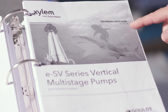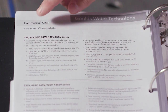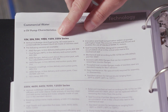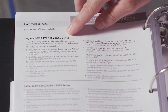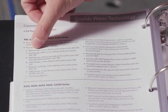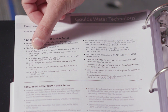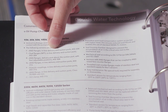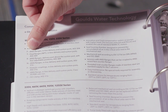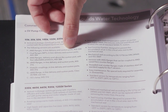For additional information on your pump bodies configuration, we're going to refer to the technical brochure again. Let's flip the page over to pump characteristics and focus on the 1 to 22 SV series. Let's pick a couple of these and talk about some of the acronyms. The first one — the F configuration — we can see it's an ANSI flange. ANSI stands for American National Standards Institute, and it has an inline delivery and suction port.